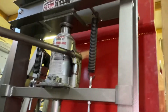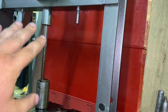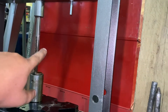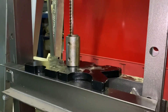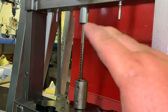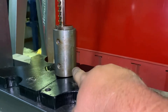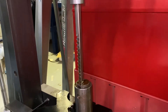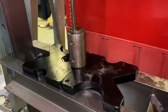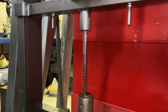Another thing — I will never broach on a hydraulic press, even when I get a 50-ton one. I like to be able to feel the response and how tight it's getting. This is hard — it will shatter. So I'll always have this press. If that's what I use it for is broaching, then that's fine, because you need to be able to feel when it gets tight. It will shatter or kick out. Always make sure you're in the middle, and go nice and slow. I'm going to be pumping it and we're cutting the keyway. As it gets close, I'll reach under there because these are hard — you don't want them to hit the ground because they'll chip. That's the way I broach stuff, and I think most people should.